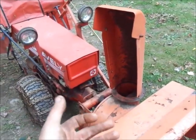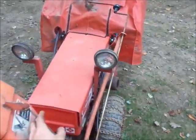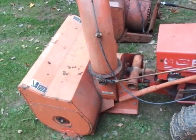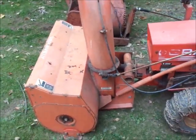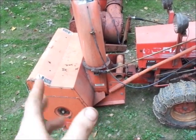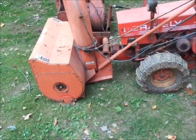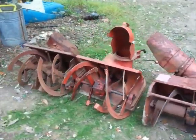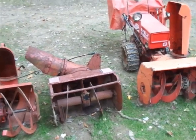The whole fan housing stays stationary and just the chute rotates - you can do that from the operator's position. They had a cable-operated deflector from the operator's position. All of the Ariens-style snow blowers are quick hitch or rider - there is no four-bolt version, to my knowledge. When the Ariens stuff came out, everything was going quick hitch. Quick hitches were actually coming standard on the 5000 series - on the 5000s you could unbolt them, but on a Pro series you cannot because of the extra clutch back there.